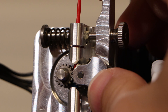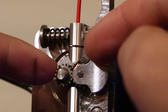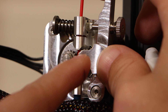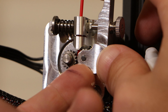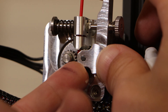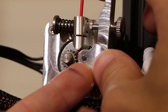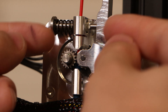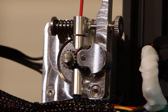I don't have the tension turned up very high, but I haven't had any slipping issues because of how much grip these little gear teeth give. The gear up here is held captive using a press-fit pin, so it stays in place and you don't have to worry about it falling apart. This makes assembly and disassembly easier — if you're having a jam or need to troubleshoot, it's really easy to see and access everything, making it an ideal setup for serviceability.